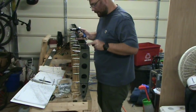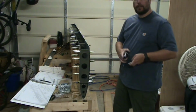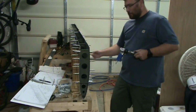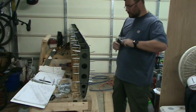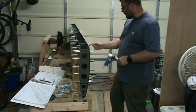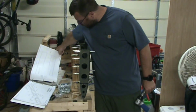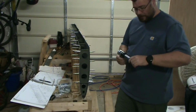So starting at step 2 of ATAC 13, what you might have seen me doing there is putting a mark on the skin. We're riveting the forward flange now, and halfway down where you have the reinforcing doubler in there, the size of rivet changes. So I was just marking a mark here and putting 3-4 rivets this way, 3-4.5 rivets this way, just as a reminder to stop putting in the 3-4 rivets. And then where the 3-4.5 rivets are, every time there's a rib, it steps up to a 3-5 rivet.